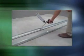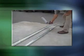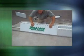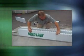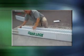Place a three-quarter inch wide bead of foam at the outside corner of each track over a distance of not more than 8 to 12 feet. Quickly place the panels in the track before the foam has a chance to set. The foam will adhere the panels to the track and fill the tie slots at the bottom.